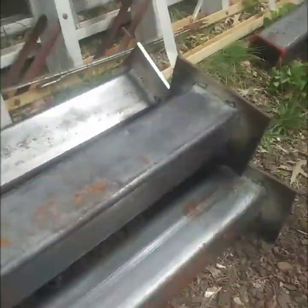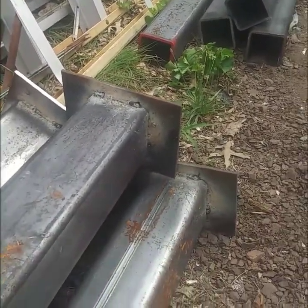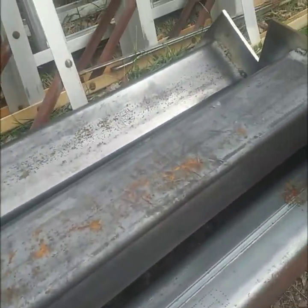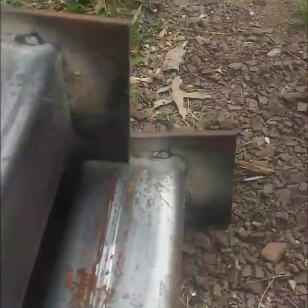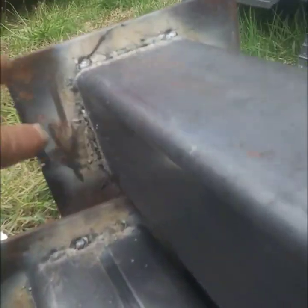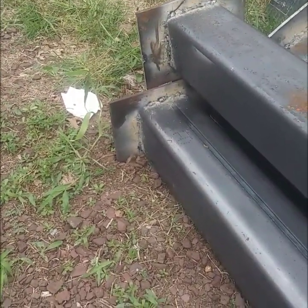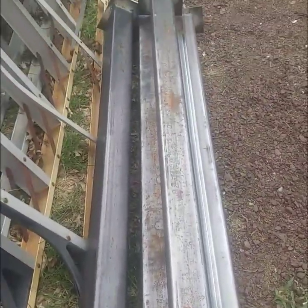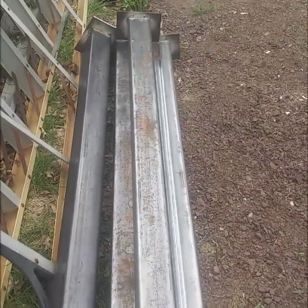Here's the quick last part of this job. I'm not going to show you how to weld — if you don't know how to weld or have a welder, you probably shouldn't be doing this work anyway. Just to give you a quick idea: we have our columns now pre-measured with a little tolerance for height and distance, and the plates are welded on. The only thing lacking at this point are the double holes here and double holes over here — that's for the ceiling and the base. We have four columns here ready to go and ready to be installed. Because they're all different sizes, each one is numbered one through four so I know where to put them based on how I measured.